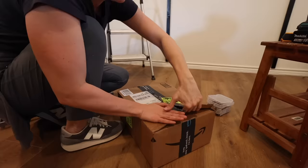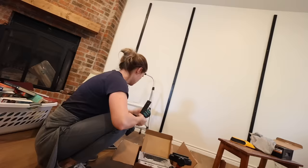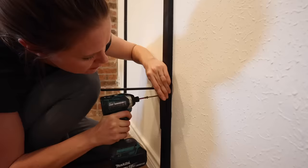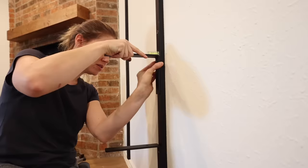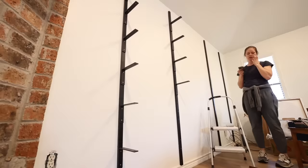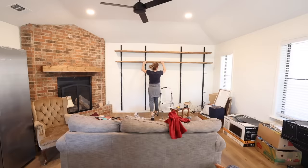I found these heavy duty shelf brackets on Amazon and I'll link them in the description. I used the most heavy-duty version I could find where each pair holds 200 pounds, because we'll be adding a ton of books and I wanted to make sure they'd hold without any worry of falling down eventually. Next I measured and marked where I wanted each bracket and started attaching them to the 1x2s. Finally it was time to bring in all of the shelves — this part is so fun because I'm finally seeing this idea that's been in my head and then taped on the wall actually take shape in front of me.